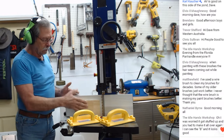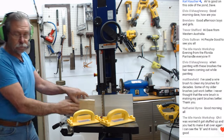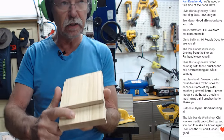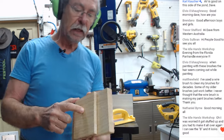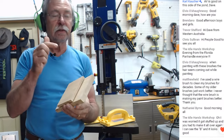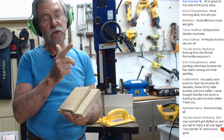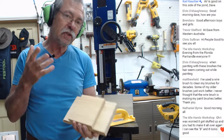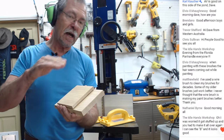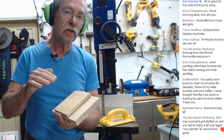This is the piece that I've got. This is the female section. This is the male section. I managed to get the male section to penetrate a little bit better than I did on the main job because I changed the settings a little bit. I set this to 4 millimeter start depth and 2 millimeters flat finish.